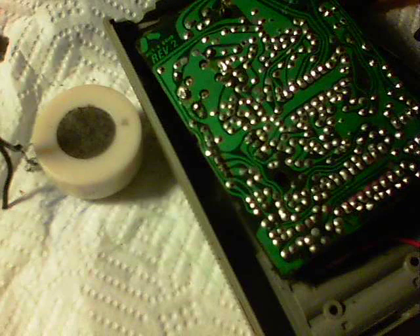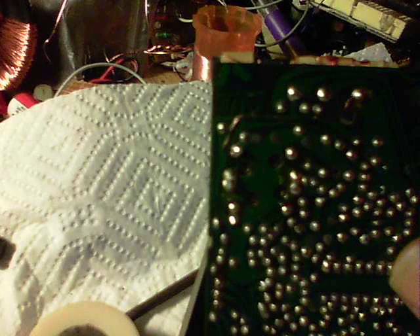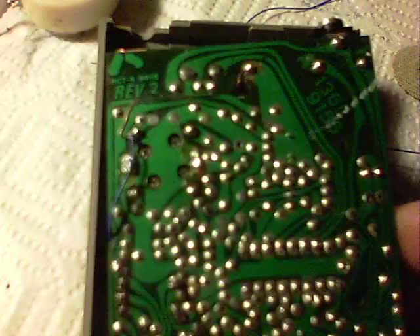I've done four or five turns so far and I'll carry on to do seven equally spaced. I'll connect up to the top pin which corresponds with one of the wires coming from the AM coil section. Once the turns are done, I'll put a bit of glue on the end and also on the wire where it meets the top connection. The last thing is to connect about 20 inches of wire to act as an antenna. The antenna wire — that blue wire — is passed through one of the screw holes in the back, and the other three screws will hold everything nicely together.